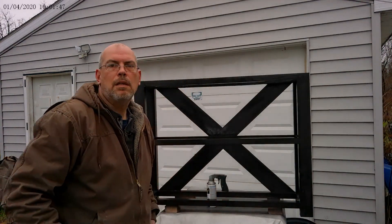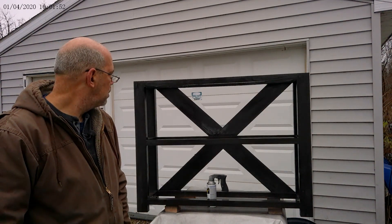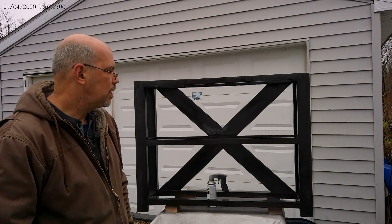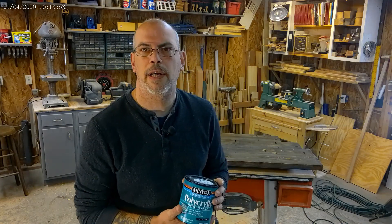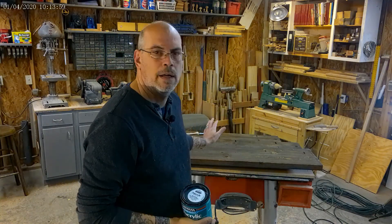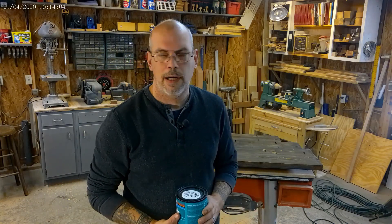It's all painted brown — we'll check back after it dries, flip it over and just hit the two bottom rails. Once that's dry we'll be ready to put the white finish on it. Now that our spray paint's drying, we're going to move on to putting our polyacrylic on — it's just a Minwax polyacrylic — we're going to put that on the top and the two shelves while the spray paint's drying outside.